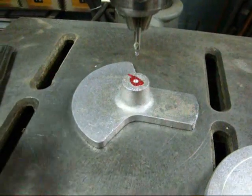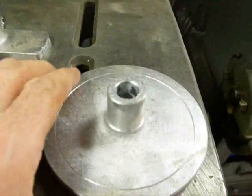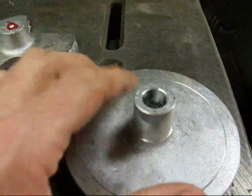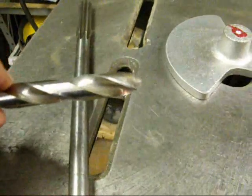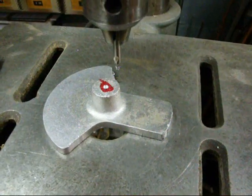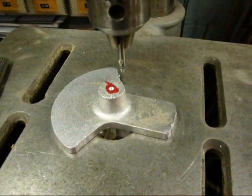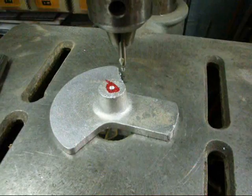Now I'm going to ream on the drill press. I'm going to ream this aluminum casting out. This is the one we just did on the lathe, and I wasn't satisfied when examining the inside — there are a few spots that didn't quite clean up. So I'm going to drill one size larger — or rather one size smaller — this is a fifteen thirty-seconds, and then half inch. The sixty-fourth under wasn't quite enough; we're going to go with one thirty-second under. It depends on the material too — if it's steel maybe the sixty-fourth is okay.